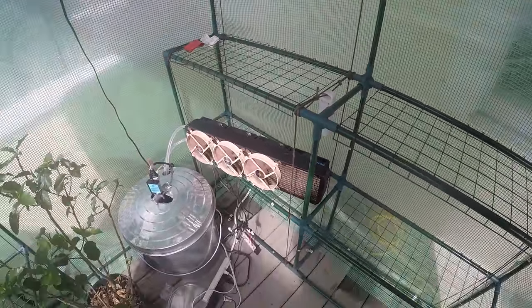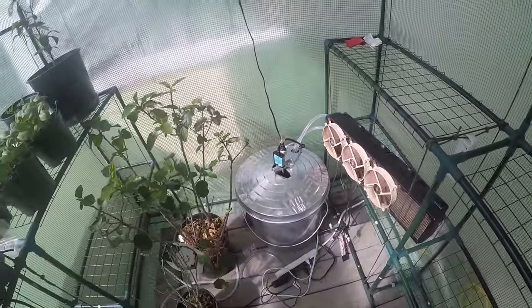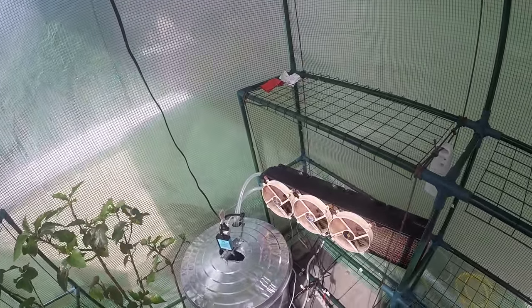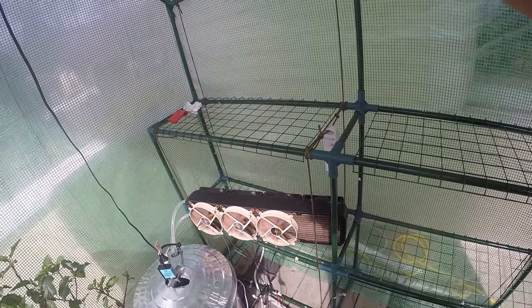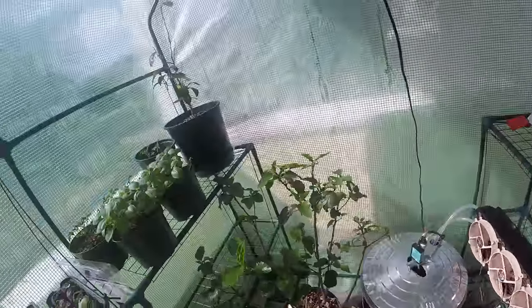Off to the real story — this is what this is. So I got a bucket heater in here, a nice big bucket heater. It will get this water up to 180 degrees if I let it. And then it's tubed in with a little pump into this water radiator — it's a big 560 mil radiator — and it's pumping out warm air into this greenhouse.